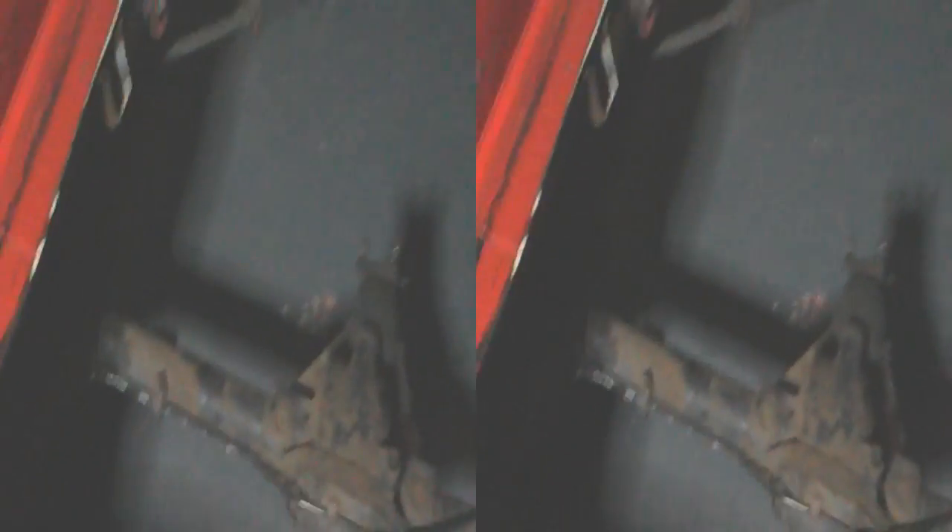Given the amount of power it has, I think we're okay. We need to fasten everything together, and if it does flex I can always simply weld a piece of angle iron. But I want it to be able to move slightly, so that as the shaft and the suspension goes up and down, it will flex accordingly.